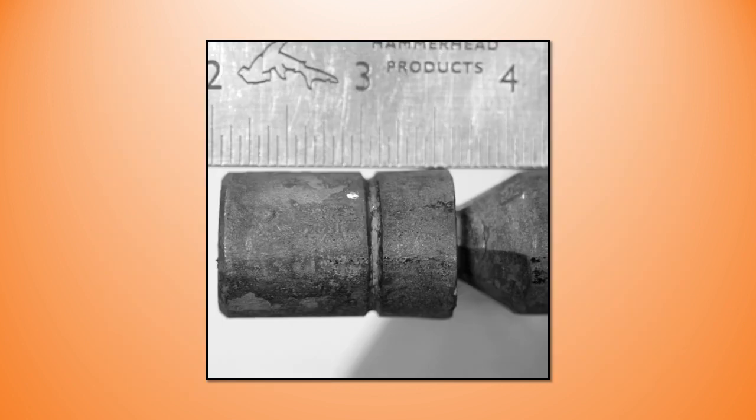As I said earlier, due to the different surface areas of the offset fullers there'll be some migration of material into the collar material, and that's something we need to be aware of later. I'm showing it with the rule balanced on top and you can see that there's a little gap there underneath the rule on the parent bar.